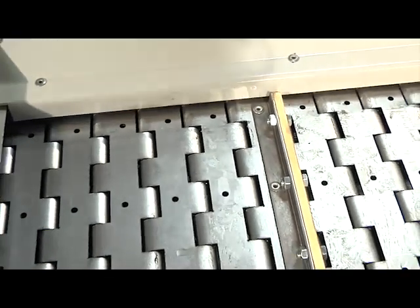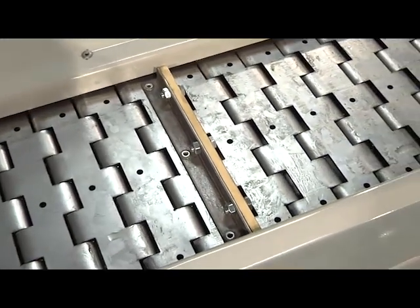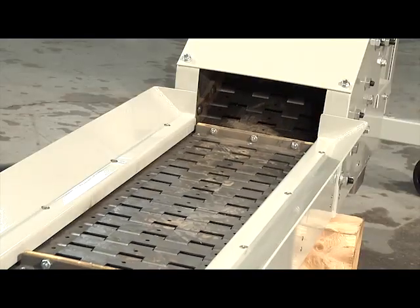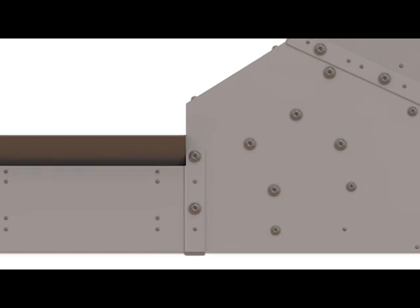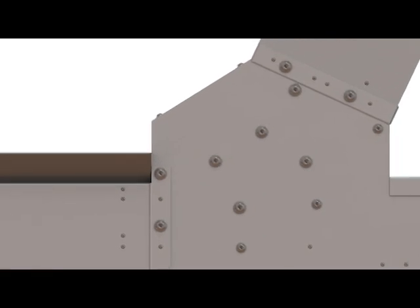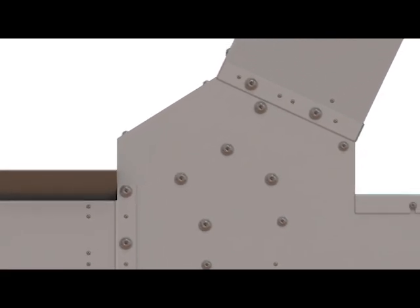Blastveyers are built in a unique way that results in a much closer tolerance roller path. The individual lasered parts are riveted together like airplanes, achieving accuracies no conventional welded assembly can possibly match.